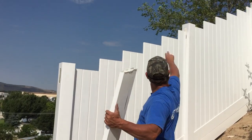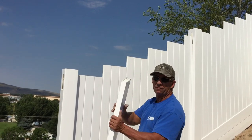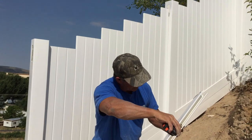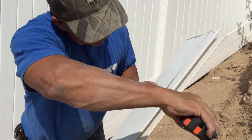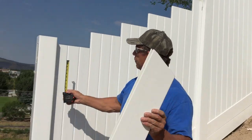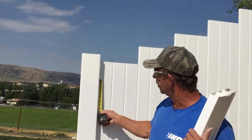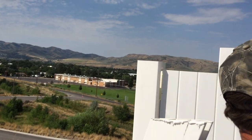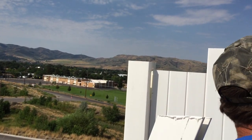You see the angle we've got here — we've got to make this angle fit this rail. Inside a rail it's like 1 3/4, we allow ourselves 1 1/4. So what we do, we measure up from the bottom of the hole 1 3/8 of an inch, then we mark a line on each one, then we pop a string, and it gets us a straight shot up to the same height.